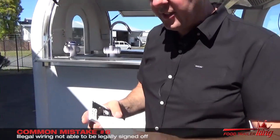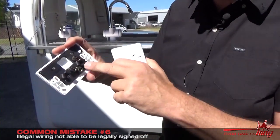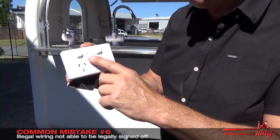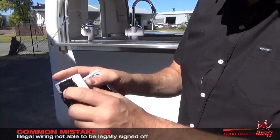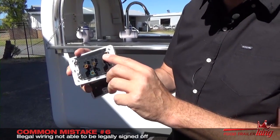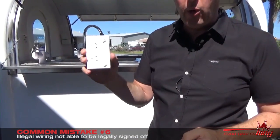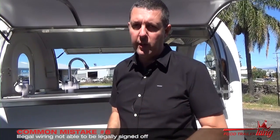Also the power points — it's really, really major. This is a standard power point, and looking at it you wouldn't even know the difference. This is a proper power point — this is the only type that can be in any food trailer. It's a double-pole power point: inside the switching section, when that switch is switched, there are two contacts inside rather than one. The reason for that is because when it's getting driven around — because it's mobile — it vibrates. If you have single-pole power points, someone has signed off on that trailer illegally. This is the sixth most common mistake people make, simply because they don't know. They're trying to invest based on price, not based on everything being done properly with no further problems.